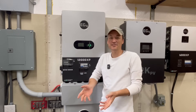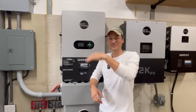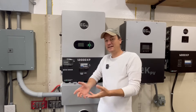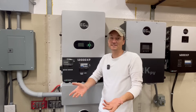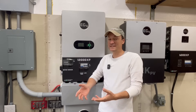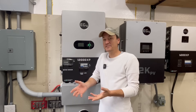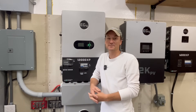Say you had a dryer on — you don't want that to just be evening out your power supply. You want to be able to charge at the same time if possible. With this unit at that kind of wattage, you could essentially charge at the same rate you're discharging — charging your batteries at 250 amps while discharging at 250 amps. If you have enough solar, that entire load would be covered by the sun.